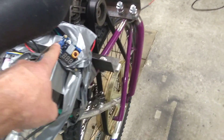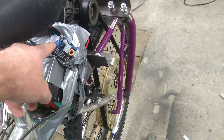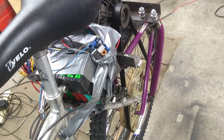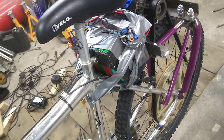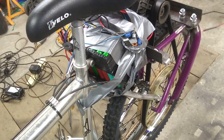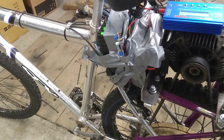This little buck converter you can see is turned off at the minute because I'm charging the batteries, but it seemed to work fine. I was able to adjust the voltage from four volts up to nine volts. To be honest, five or six volts seems to work about as well as any — four was a little bit low and nine didn't really help any.